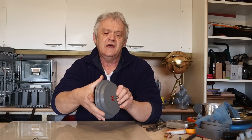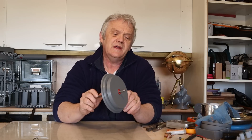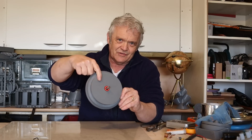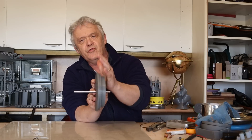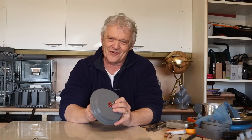There's a really interesting effect: if we hold this flanged plate here as the base plate and turn the drive sun, then it will turn the planets at a 200 to 1 ratio. So this, which is now the drive gear, turns incredibly slowly and with a huge amount of torque. And although my pancake version here is actually quite large so we can demonstrate, this can be incredibly thin. It's really rather awesome and very difficult to stop that turning.